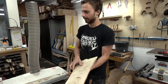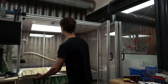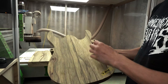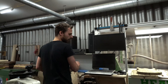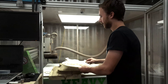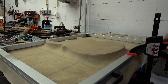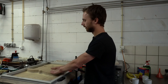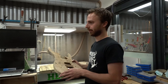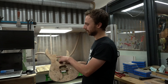After the woods have been processed for the body, a piece comes out like this — already glued together and through the thicknesser, nice and flat. We put it on the CNC and make a pre-glue cutout with little locating pins, which helps in the production process and also helps me find a suitable top — for instance a burl poplar top that can be fitted on here and glued really easily. To glue the top and body together we use a vacuum table I made myself. The vacuum makes sure everything is held in place properly, with the same amount of pressure at every spot on the contour.